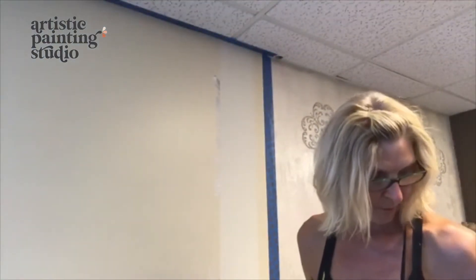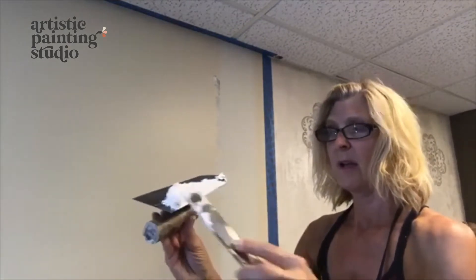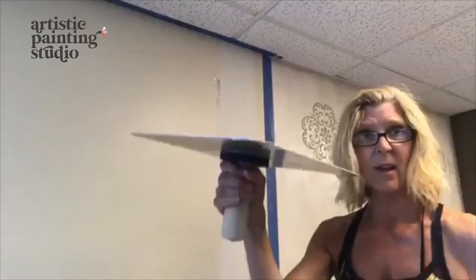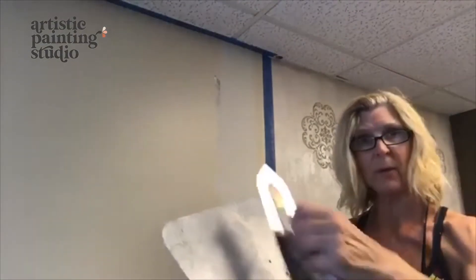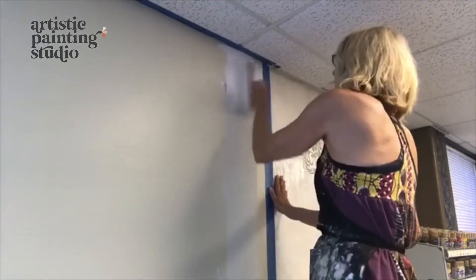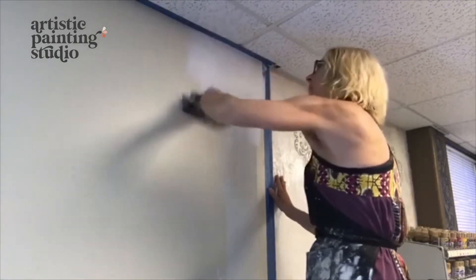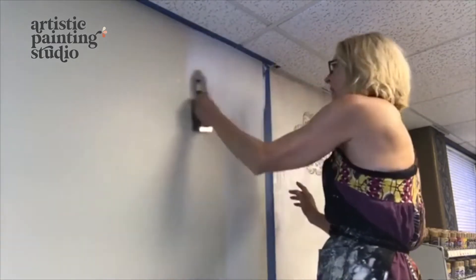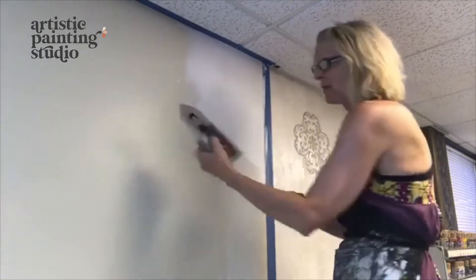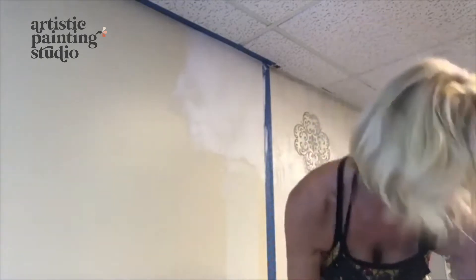I'm going to pull it right out of my bucket, put the Texture Medium on the side of my trowel, and try to keep you at an angle where you can see what I'm doing. When I'm doing big walls and hustling, I go to a hawk — basically a flat surface with a handle on the bottom — so you can put your product right there and just pull right off. I'm starting at my ceiling line, getting on a nice thin coat, and because I'm doing this by myself I can only trowel out sections so big before I have to run the roller through it and make sure the product doesn't start to dry on me.